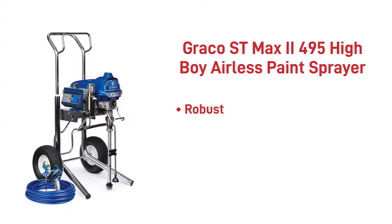These sized pumps are suited to the mid-sized structural steel and steel fabricator sectors, where mainly high build primers and viscous two-pack epoxies need to be coated onto large surface areas swiftly and with multi-layer protection.